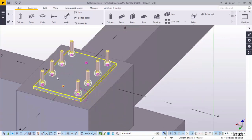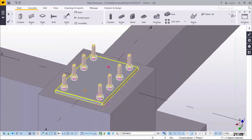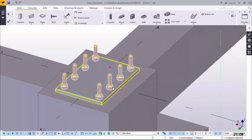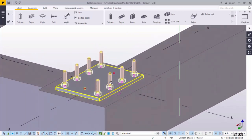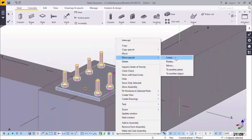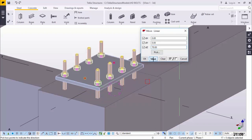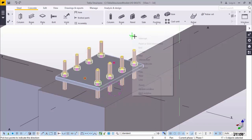If I press Alt here and pick on this, you'll see everything selected as a unit or as an assembly. Now I want to just bring it up by 70 millimeters to provide a space for the grouting when the column will be in place. I'll right click and come to Move Special, click on Linear, then feed 70 here and click Move Up. There we are. Click OK.